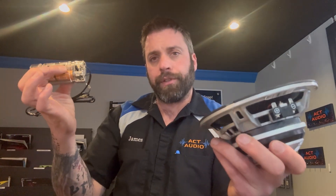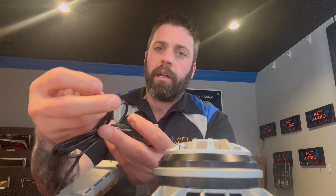Depending on your setup and how elaborate you want to go determines how you'll use this. The most basic way: channel one comes out of the amp to the woofer, then from the woofer out through this crossover back to the tweeter — you share the channel and this filters your sound. Some also recommend filtering through the DSP. You do want to add a cap outside the frequency range, because if it's within or close to the frequency range it'll cause problems — I've seen it cause a peak. Keep the frequency range separated, go a little lower, and it helps throttle power and reduce chances of blowing. If you're hooking these up on your bike and keeping it simple, use the crossover — go from the amp to the terminals, out of the terminals.